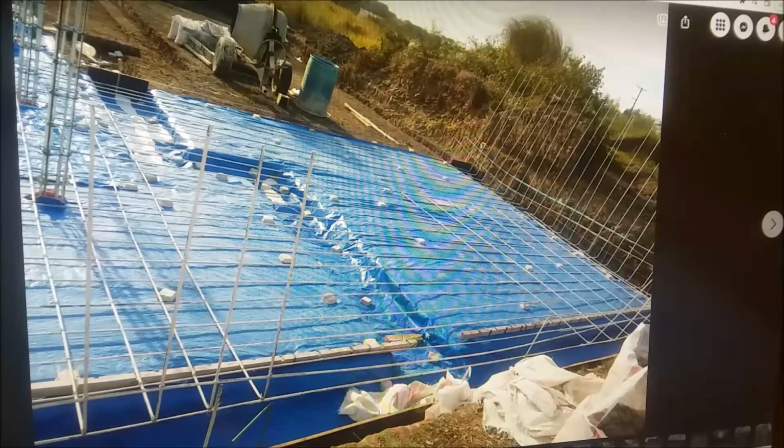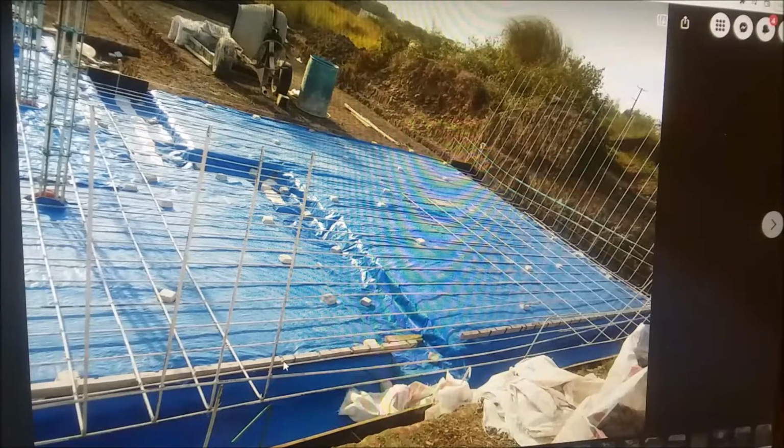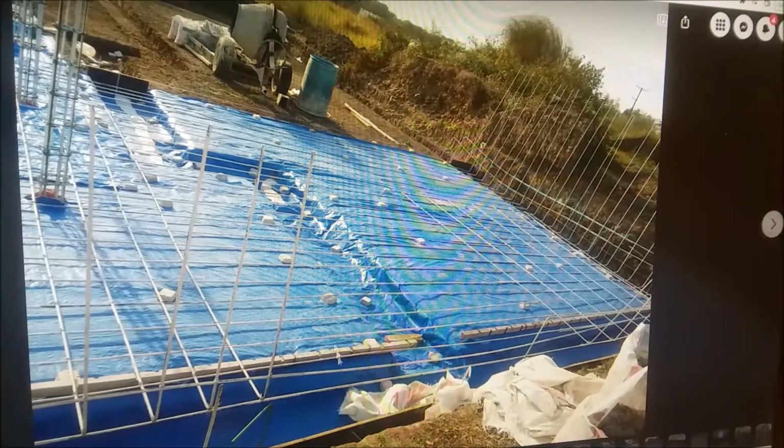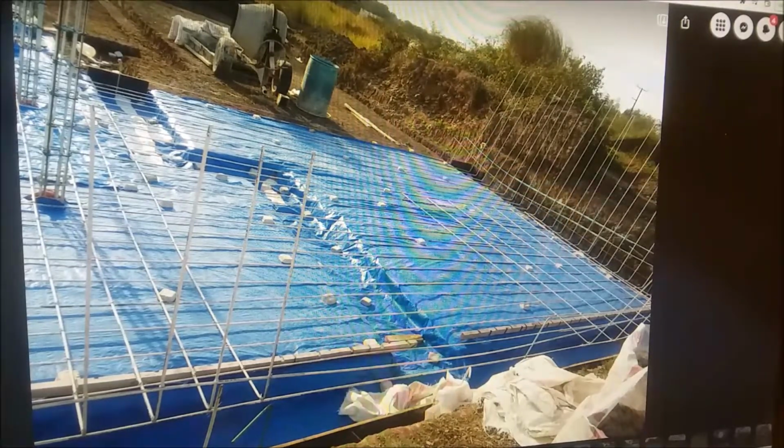This is the east side. You can see notched boards down here. I wasn't clear about the fact that there's going to be a 5-foot round window here and a door over here on the other side, and that we didn't need any uprights. So it's going to cost 6 man-hours of labor to cut the tie wires, get them out of the concrete so they won't be sticking up, and put the correct bars in there. Better than that, we'll be cutting off short pieces and replacing them with long bars.